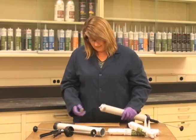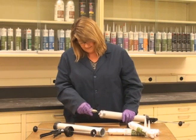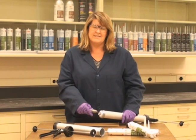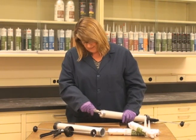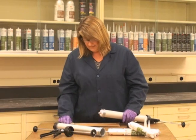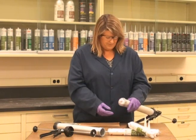In order to open up the sausage pack, all you really need to do is make a slit in the end that's going to be parallel to the crimp at the end. It's not necessary to cut off the entire crimped area — a slit about a half to three quarters of an inch long is more than enough to get adequate flow from your applicator.